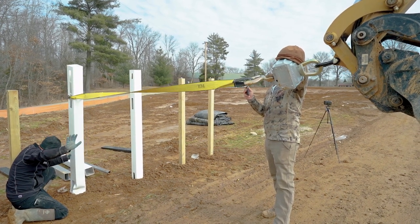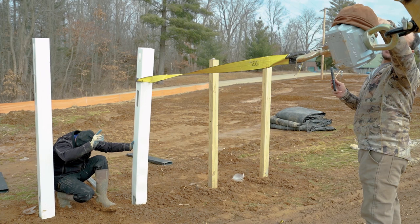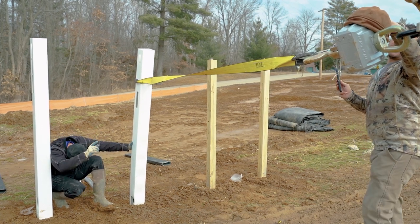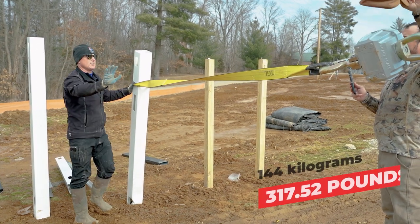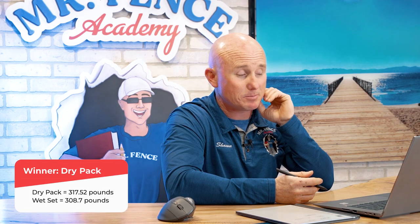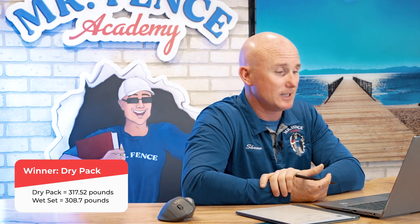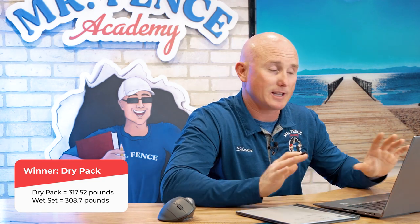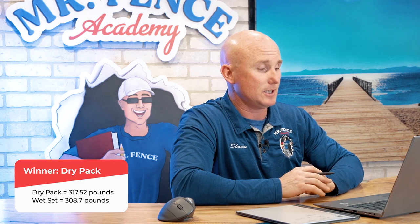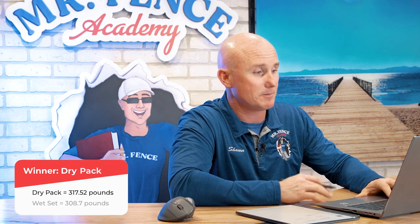9.5, 9.4, 11.8, 12, 13.8, 14. Oh! 14.2, 14.4. 14.4 on this one. I don't know why all these are just 0.2 higher on dry pack. I think that's a chance. I can't imagine that the dry pack's adding that 0.2, but maybe it is consistent. But end of the day, the posts are definitely failing long before the concrete. They're consistently failing at about the same lateral load.